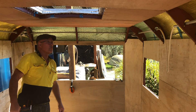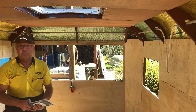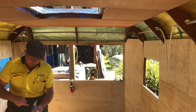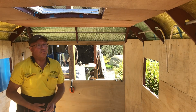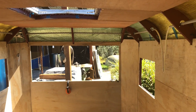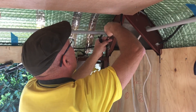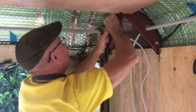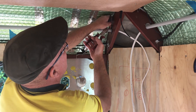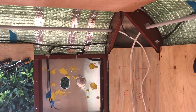In these commercial kitchen vans we're running two 15-amp inlets. The issue is it's easy to overload — 15 amps is quite a lot until you start talking about heating circuits: kettles, toasters, anything like that. You have to be selective on what you use. You need a system so that if you've got a water heater you can turn it off on one circuit once your water's up to temperature, then use that circuit for other things. If you've got storage in the system you can keep going until you run out of stored hot water. Load sharing is the answer — being sensible. Build it like a spaceship.